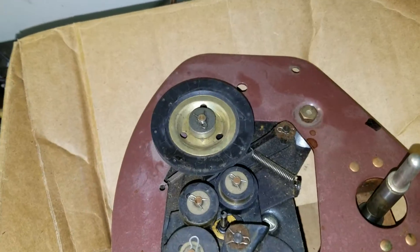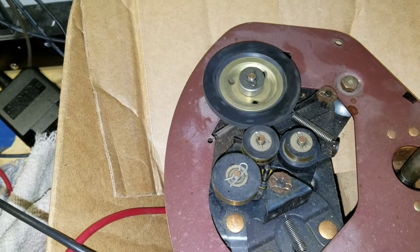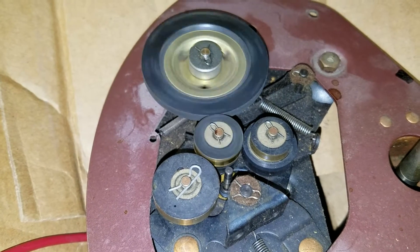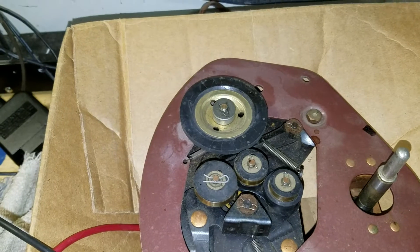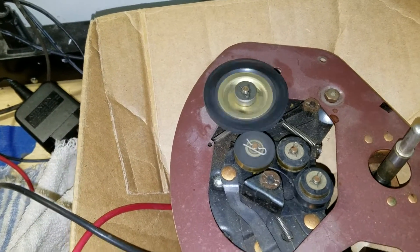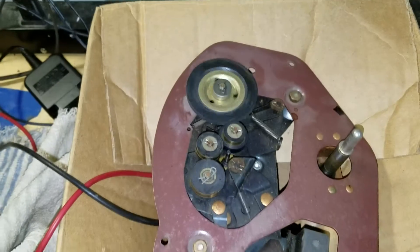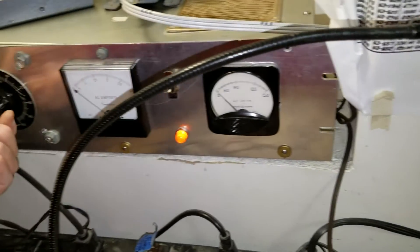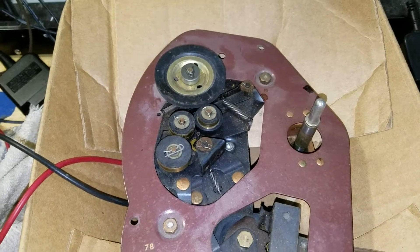I'll kill power to the Variac for now. Let me put it on a speed — just for giggles. Nothing's going to happen... Hot damn, check that out! Listen to that — that doesn't sound too bad, I think that's going to work. I don't want to touch that frame while it's energized, so I'll just handle the plastic switch carefully. Let's move it up to 78 — check it out, that's smooth, that's going to work great. That was 45, now we'll go to 33. Looks like I'm getting caught on the cardboard, so I'll quit while I'm ahead. I've demonstrated that the motor works and that the speed control linkage works smoothly, engages the turret, pushes it up against the idler wheel, and the idler wheel turns.